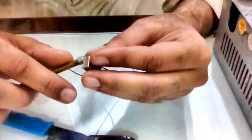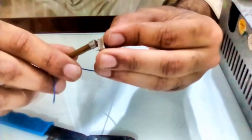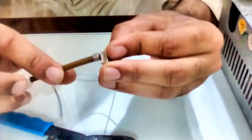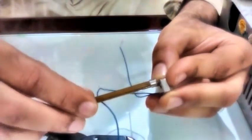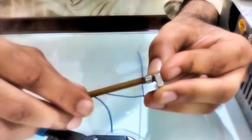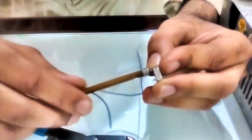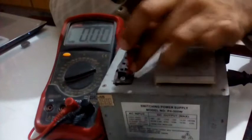One pin is already wrapped and here is the second one. Gently put the wrapping tool over the pin with the side hole with the wire to be wrapped, and a gentle rotation. After a few turns, I will have a strong bond between the crystal pin and the wrapped wire. So we have the power supply wire connected.